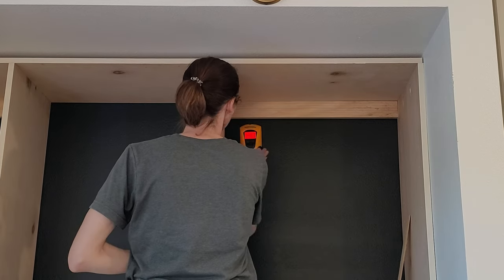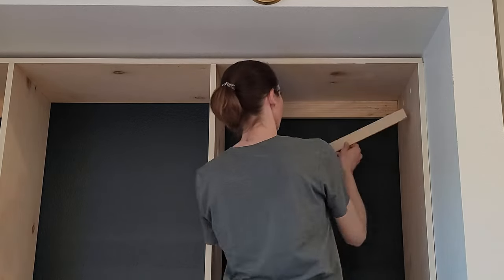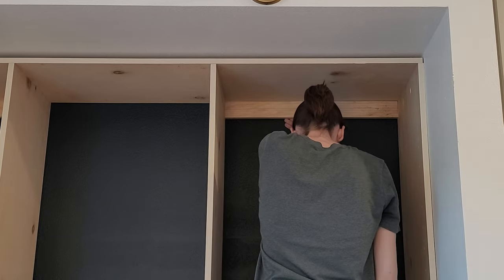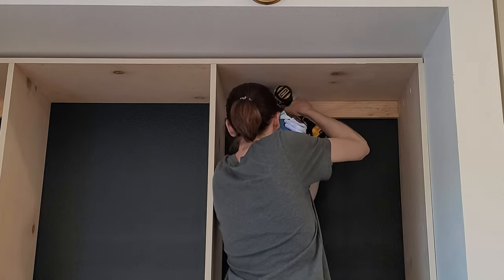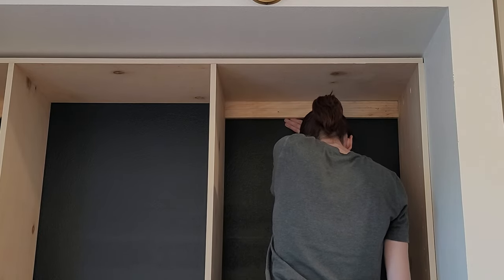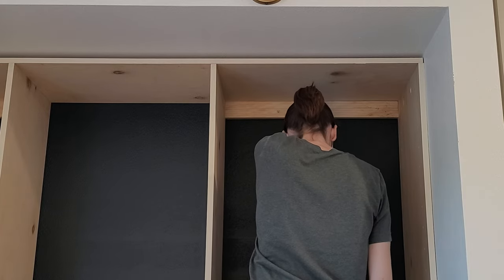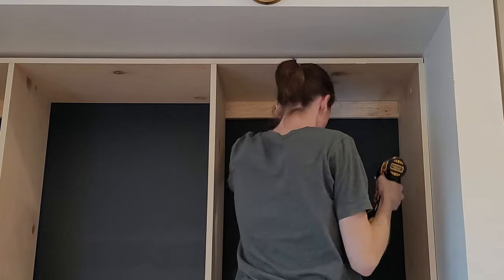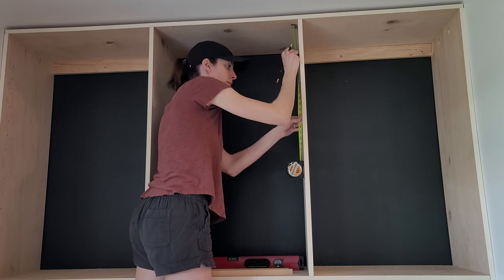Go ahead and place your cabinet in the space. Now it's time to attach it to the wall studs, so I'm using a stud finder. My cabinet is not pushed all the way back and not all the way flush because I'm going to be adding cabinet doors and face fronts. I positioned the cabinet where I needed it, and when you add the shims you want to make sure you can't see them. My cabinet is kind of high so I had to push those shims up there, but that makes sure it is flush against the wall evenly on both sides. I get my shims from the hardware store in various sizes, and then I use three-inch wood screws to attach it to the wall studs.